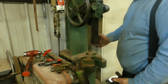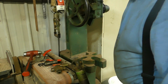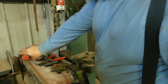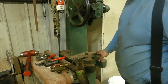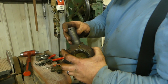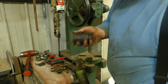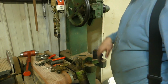It's pretty large. I don't know what the jaw size is here, but if you look, here's a Snap-on hammer that actually would fit in that arbor press. So it's pretty large. It's been pretty nice for U-joints and other stuff, but we'll get this install done. I'm using a 7/8 socket for my press driver, and what size socket fit perfect on this John Deere? A 36 millimeter Snap-on socket. So that's going to be what I press into, so we'll go from there.